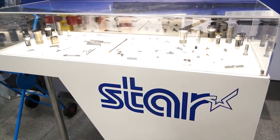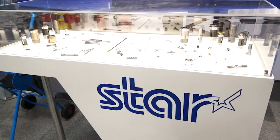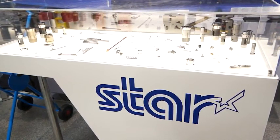And how would a customer go about setting this on their machine? The macro itself we give freely out to any customer that wants to use it. It was developed for fastener companies in the Midlands, but we've given it to many customers that are machining similar features on their components. So it's good for hexagons, it's good for keyways, those sorts of features we all do with this shaving cycle. So that's the broaching, but what about the engraving?